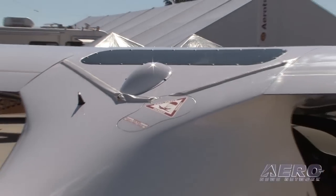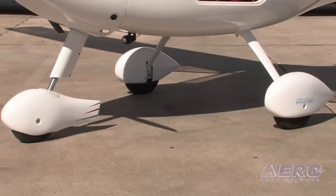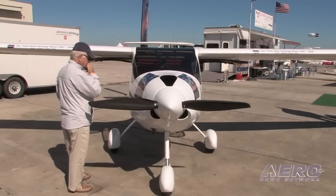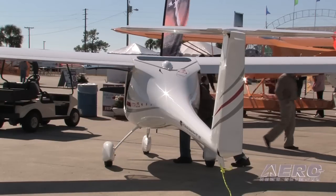For those interested in the aircraft, let's talk about the construction, how it's built, maintenance requirements, and how it will be supported in the U.S. It's primarily carbon fibre — about 95% carbon fibre. There is Kevlar used in the safety cell to provide protection to the occupants. Things like the undercarriage are fiberglass to give them flexibility, because if you made an undercarriage out of carbon it'd break the first time you hit the ground hard. It's a mature design with nearly 400 produced and a good track record for reliability. The highest-hours example I know of is 8,000 hours, based in Germany and used in a flying school. It started off with a 503 engine but quickly had a 912 installed when it became available, and they just keep using it for training.